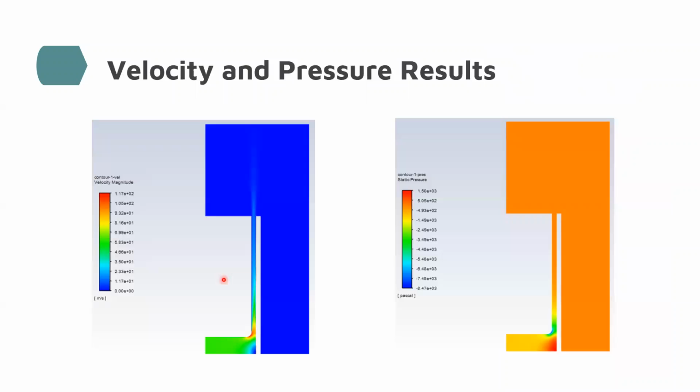So first, the static mesh results. You see kind of what you expect to see with velocity. Velocity is moderate here and then picks up really high right there, right when it meets the substrate and has to get forced through that tiny opening. And then it looks like mass is not being conserved here, but because it's axisymmetric, the area that the flow is going through goes way up, so the velocity goes down there. And then over here, you see the low pressure zone, which is what's picking up the CD, and then the high pressure zone, which is that impinging jet that we subtracted off.